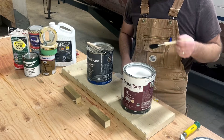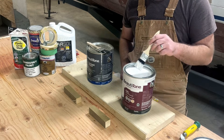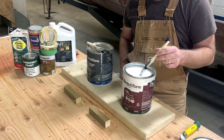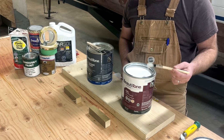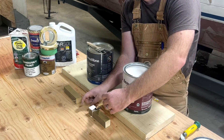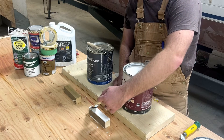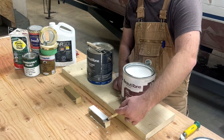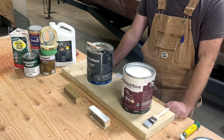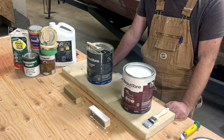So I got this primer open. The texture of the paint is actually really nice, and it's not an overpowering smell. Some oil bases, when you open them up, you get a lot of fumes coming off — this doesn't really have that much. So let's take our brush. I like to use the Bennett pure bristle brushes. I like to put my primer on in a thin base coat, and I leave my primers for about 24 to 48 hours just to make sure it's a good dry coat, then come back and do another coat, so I have a good primer base on the product I'm painting.